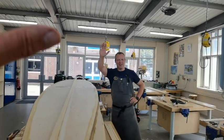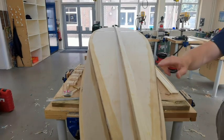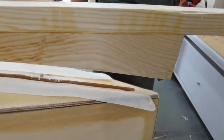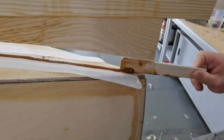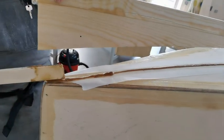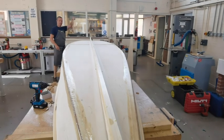Hello Mark. Hello Neil. How are you? We're now on an amber Met Office warning for heat. And here I am, epoxy in a canoe - look at him in his skirt! I've got this bit in the centre now. The keel's been cut, carved, shaped, and they've now got a bit of adhesive on it. You can see I've put a stripe of the epoxy adhesive along here. What we're going to do now Mark is attempt to actually get this thing glued on. I've saved a little bit in the pot to just dab on the end. I've piped it on - striped down the centre there. I've marked the centre here and we've had a little dry run before.